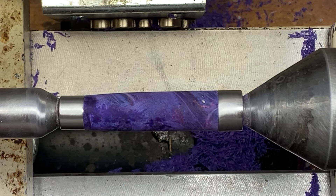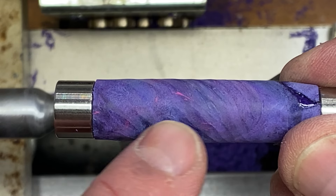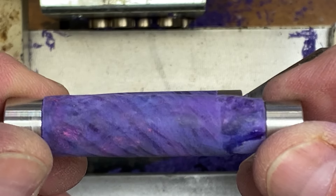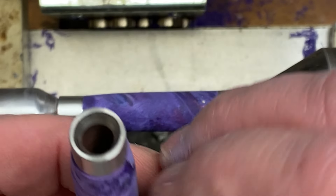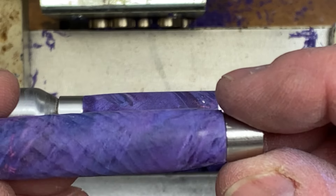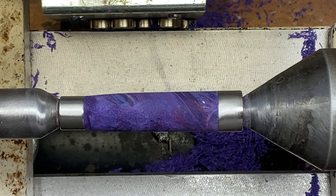Then we'll get the other blank on the lathe and start cleaning it up. I'm glad I left a lot more meat on the other blank. I still have that damage at the end, but I don't think that was me — I think my Magic Skew is fine, the carbide's fine on it. I think the whole issue was I had a wobble in the blank from the bent mandrel. Here's a close-up — you should never see this, and that is a direct result of a bent mandrel. But look how much room I have at the end. I think I can sand a lot of this away and hide as much as possible. I think it's going to work out just fine. Let me get this one finished, and then we'll move on to the lower blank.